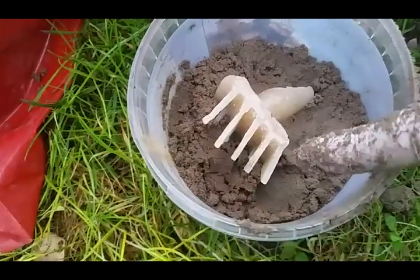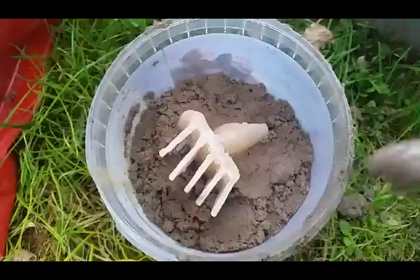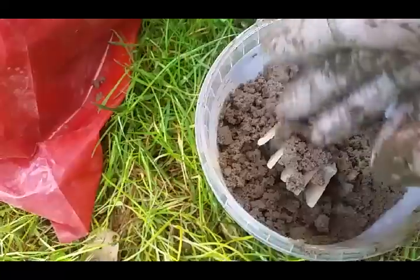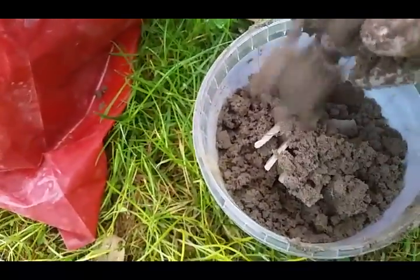On this one I'm going to tip the aluminium from the top end across these fins, because the first time I tried this the fins seemed to get air bubbles in them. Make sure that's packed down — this is quite a fiddly shape. It's going to take a bit of care packing all around.